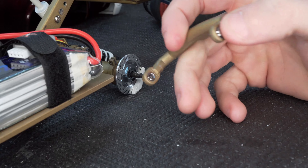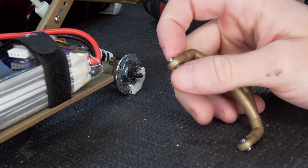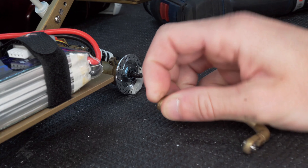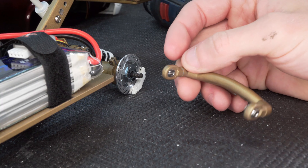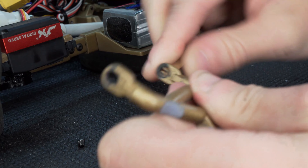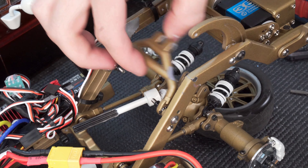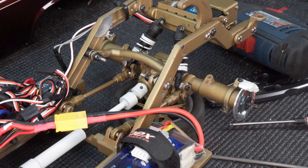The way I've been solving this problem is popping the pivot balls out, doing some sanding and cleaning, getting as much paint as I can out from the rod ends as possible, and then slapping the pivot balls back in and hoping for the best. We're going to try that first — if not, we may have to look into some other solutions.